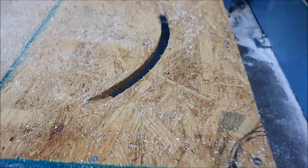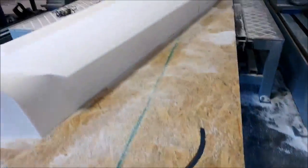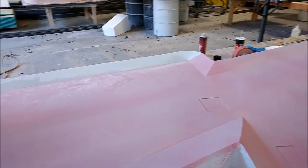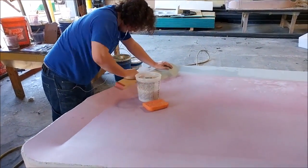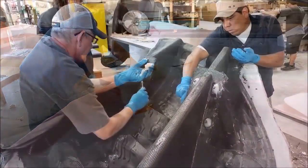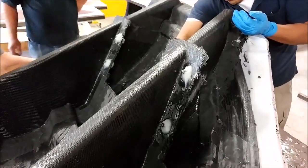This is what happens when you're not paying attention to transitions between tool paths - that bit went through in the middle of the night and cut right through the plywood. Fortunately it didn't hit the steel, which would have been a disaster. Sometimes mistakes still happen. Here's Devon working on the first of the lower wingskin plugs, sanding to get that one further along.